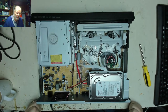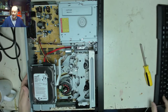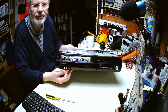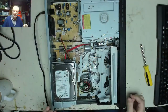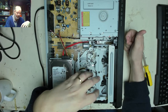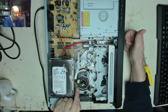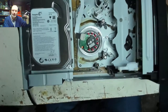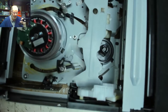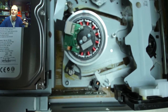Sometimes that certainly does things. So we've got light. It says please wait on the front panel there. You can see please wait is showing on the front. Now that's usually due to a dew sensor, because if you move a video recorder from one environment into another, you can get dew occurring on the drum, and the dew sensor is usually mounted around here, probably something like that little piece on the top there. Get the old camera in there. Ooh, suddenly started itself up. So the dew sensor obviously determined that it was safe enough for it to start up.